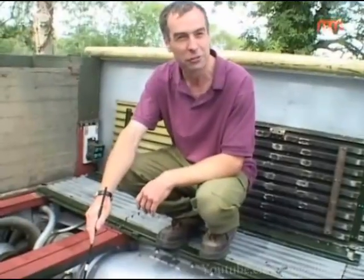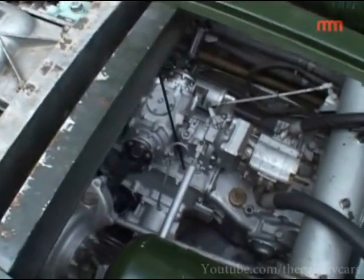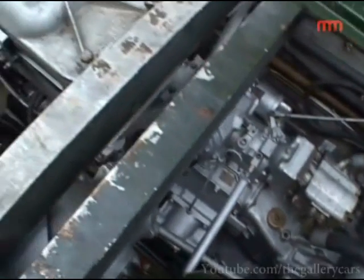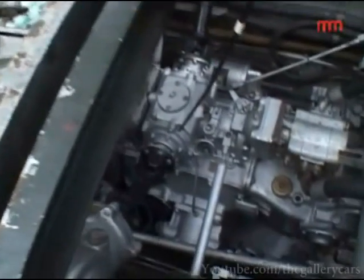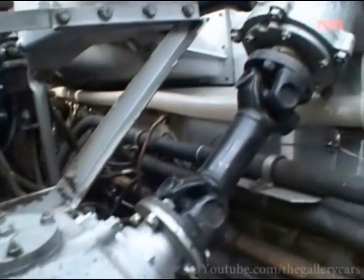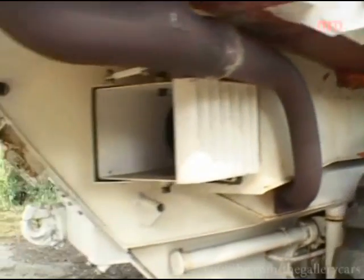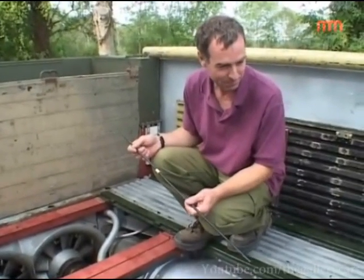Underneath the floor is a Rolls-Royce B81 petrol engine, which is an eight-cylinder, six-and-a-half-litre straight eight — which is the wrong way round, actually — driving into a five-speed gearbox into a transfer box, and then the drive comes out from the transfer box sideways, then forwards and backwards inside the hull, and then through bevel boxes out to the wheels. So it's a very, very complicated drive system. The water propulsion system drives off the top of the gearbox as a PTO, through prop shafts into bevel joints, across shafts, and into the actual jet drives, which provide the thrust for driving in the water. It's an absolute nightmare to work on because you end up in all sorts of contorted positions, but I've spent many a happy hour fiddling around with the old girl — they're great fun.